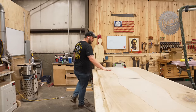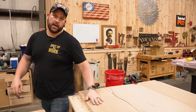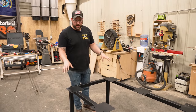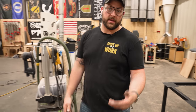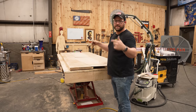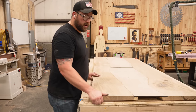Everything that needs sanding on the top is done, the river's fixed, and it's looking pretty awesome. The next thing I need to do is cut the pockets for the table base. We custom built the base, sent it out to powder coat, and now we need to mount and recess these plates. We have to keep perfect orientation with the table in two pieces, so we're going to clamp the table together with the template inside and flip the whole thing over to position the table base. I don't know another way to do this — if you do, let me know.